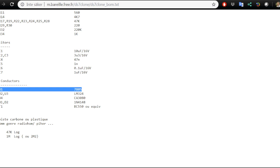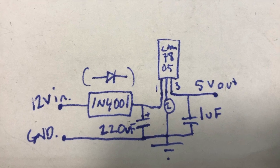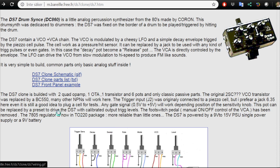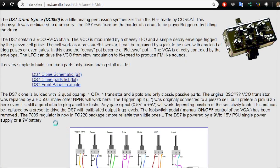There's also the parts list, which is good to have. The 7805, which it has here, is not in the schematics, but I did a simple 5-volt regulator with a 7805 as well. I'll show that circuit. Also, the C5 here says 0u1, which I interpreted as 0.1 microfarad, but in the parts list C5 is actually 1 nanofarad. So I'm guessing the parts list is the correct one. I changed my C5 to 1 nanofarad after having to error-check a faulty LM13700, and in that check I switched that capacitor as well.